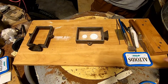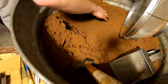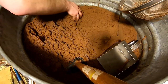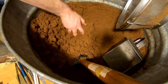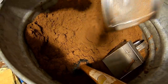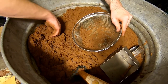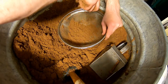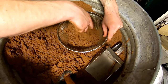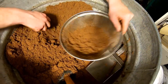Flour is cheaper than baby powder and works just as well. He's now sifting sand on there so it doesn't block up on the design — if you put it on as big chunks they'll roll and pull up the flour, but sifted fine it doesn't disturb it. You want no black bits in the sand either; those could be burnt sand or tiny cooled metal droplets. This is foundry sand — we ordered a 50 pound bag.